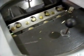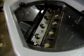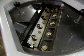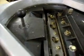You have a large turntable set in the head so that you can vary the skew angle on the blade for cutting different woods. I don't know if I can turn this with 2 hands, but as you see there, you can set a rather acute skew angle for doing soft woods, and then turn it back for hardwoods. So we'll leave it there.